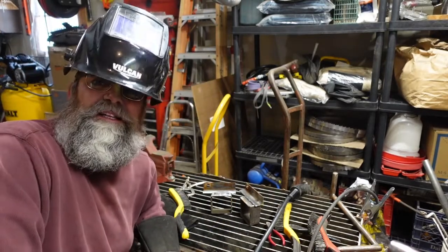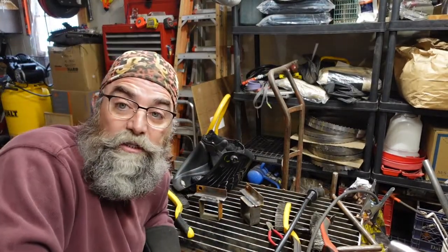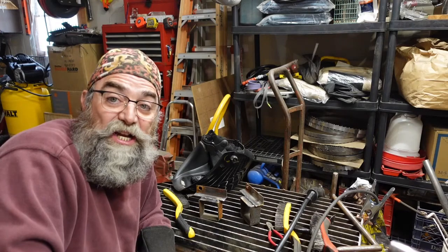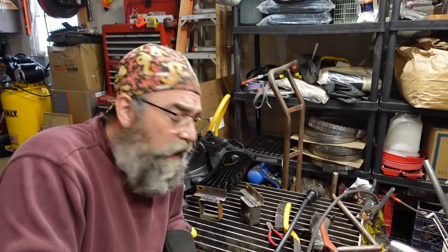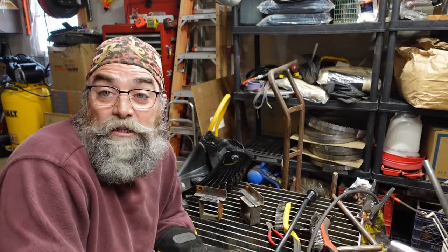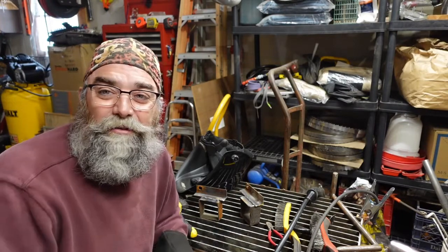All right folks, I tell you what — for my money it's definitely worth it. That's quite a difference. I like the wire, I like the gas a lot better. We're going to go ahead and continue with our welding. A lot less messy, a lot less splatter, a lot less clean up — it just looks so much better. So that's going to do it for this video. I hope you enjoyed that — now you can see the difference between flux core and gas shielded MIG welding. I much prefer the gas shielded. We'll see how much more this costs, but the quality is definitely there. Like, share, subscribe, and as always folks, God bless.